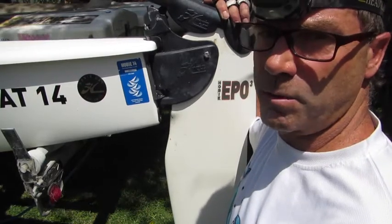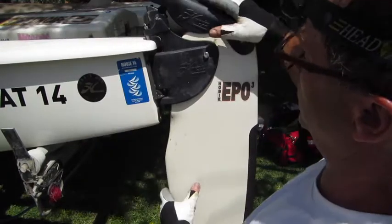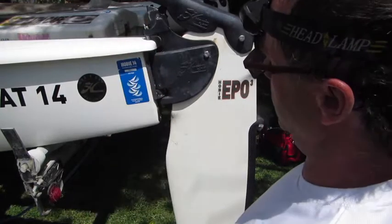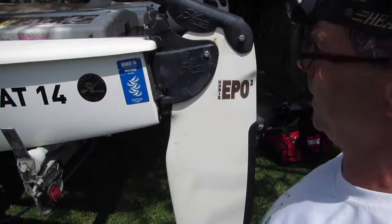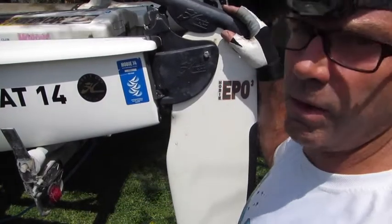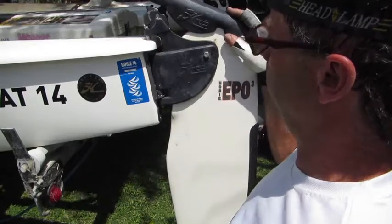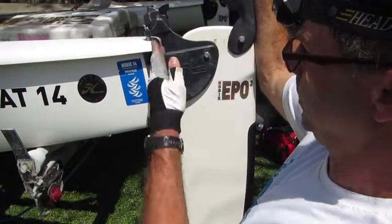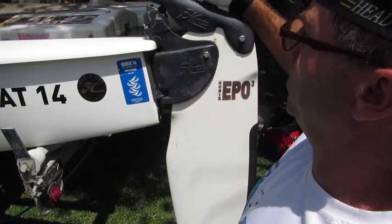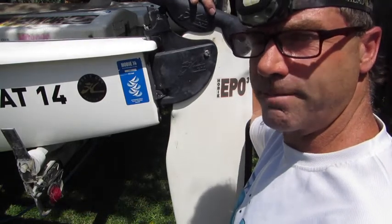I've done it on quite a few boats — 16s as well — and it seems to work and the boat just sails beautifully through the water. So that's all about rudders and rudder cams and the whole maintenance on it. Rudder pins are straightforward. I'm not going to worry about toe-in — a little bit of toe-in on your rudders is pretty straightforward. But today was mainly about replacing cams, setting up that spring tension, and setting up this top bolt, and that's all you've got to do. I'll take it for a sail and see how it goes. Thank you.